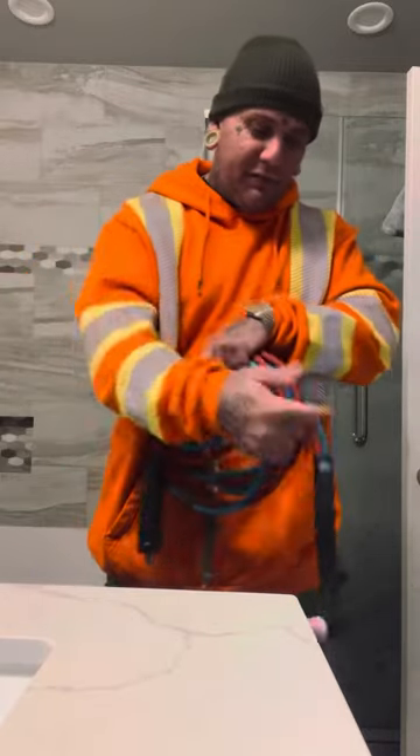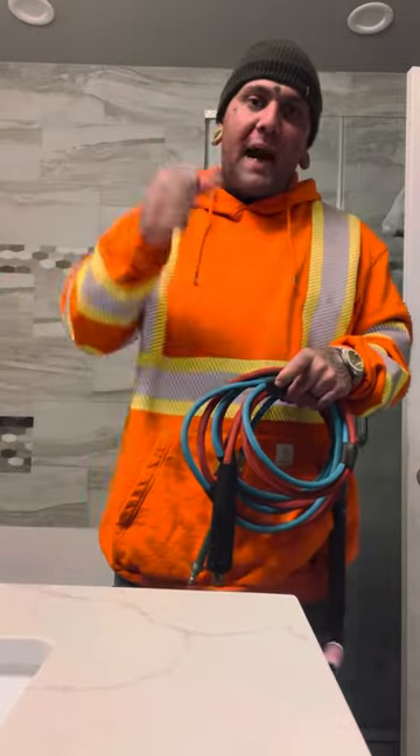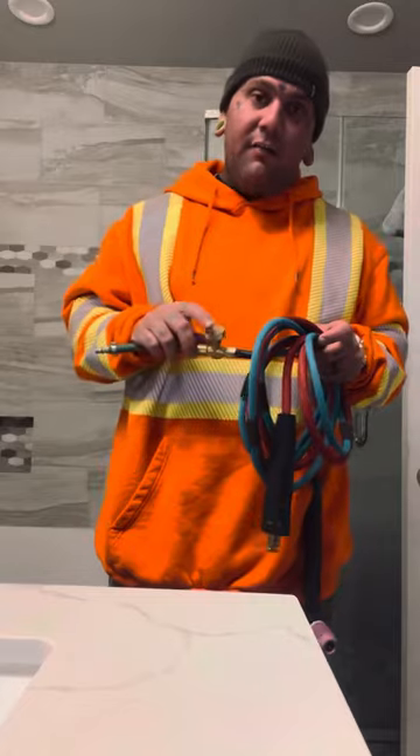Them single leads with the argon blowing through it all at once and you ain't got that valve down there — you're just using that head valve. That ain't too good, bro. You spend a lot of money. Your hose is always popping. You shut it up at the valve. If your rig's hot and you've been burning, toting that iron, that hose is going to pop. Then you got to cut it, fix it, repair it, go buy another one. This right here eliminates all that.